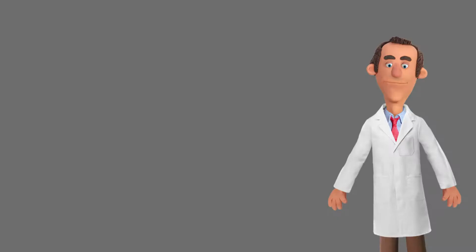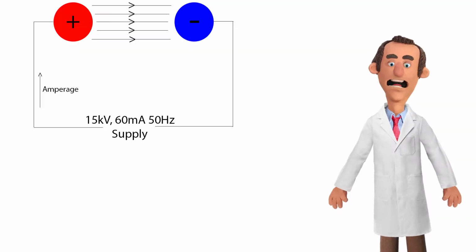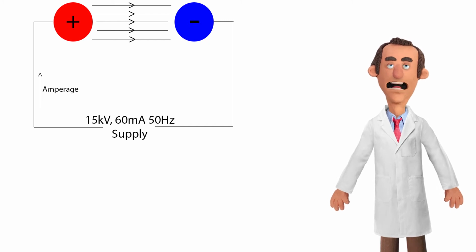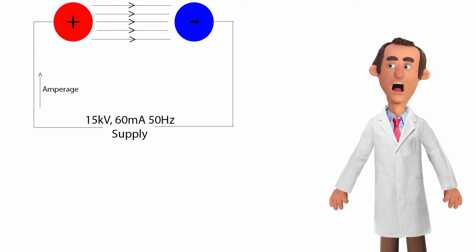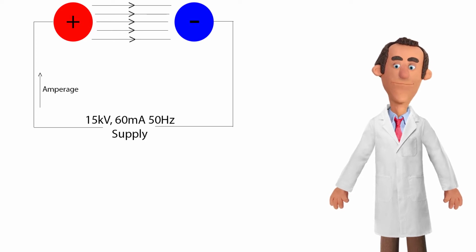You have two types of materials, conductors and insulators. In conductors, like metal, one or more negatively charged electrons in each atom are free to move about. This is what we call a low resistivity, and it makes them good conductors. Insulators' electrons are tightly bound to the atoms and therefore have a high resistivity and don't carry charge very well.